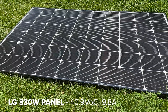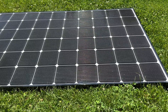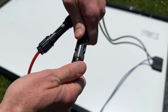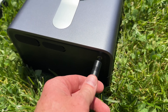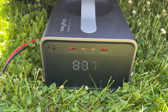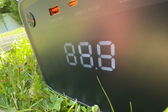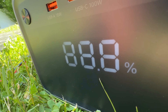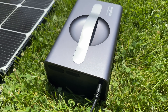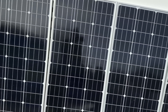For the ultimate test I plugged in my LG residential panel at 40 volts — just at the limit for what this charge controller can handle. Using an MC4 adapter I got from Amazon, it worked great, though the panel outputs around 8–9 amps and the charge controller can only accept just under 5 amps, so we're over-paneled at this point. But you can definitely max out the voltage at 40 volts and it works great for DIY folks.